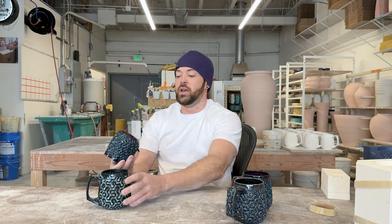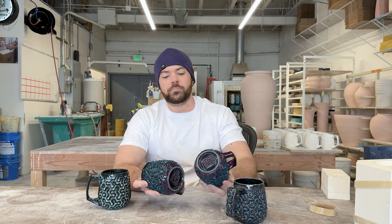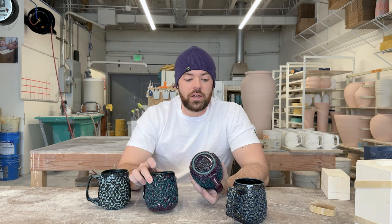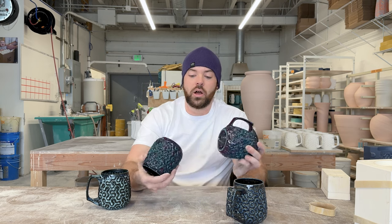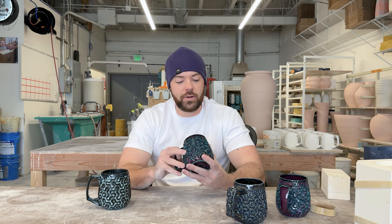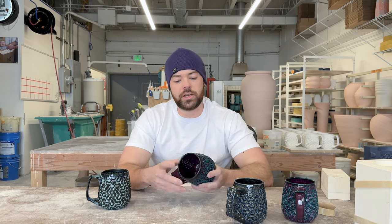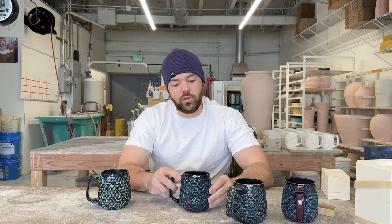I should also mention that I modified the foot. In addition to the new 2024 design versus 2023, the foot itself is about a millimeter more narrow and about half a millimeter more shallow depth-wise. That doesn't make a noticeably dramatic difference on the outside, but on the inside the dip where the foot is in the cast pieces comes out a little cleaner with this thinner foot.